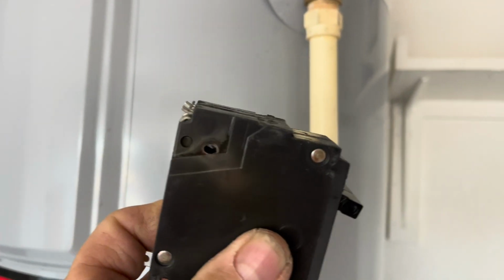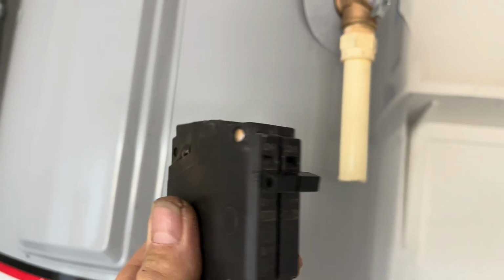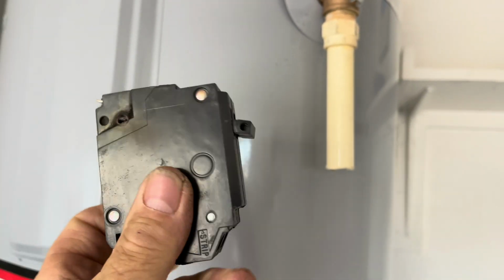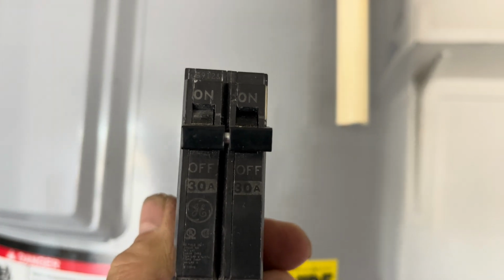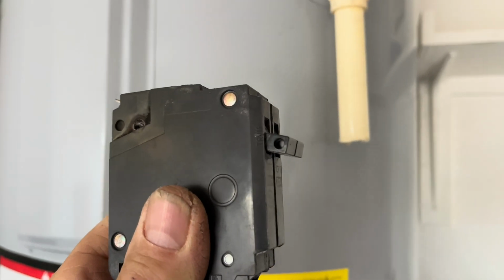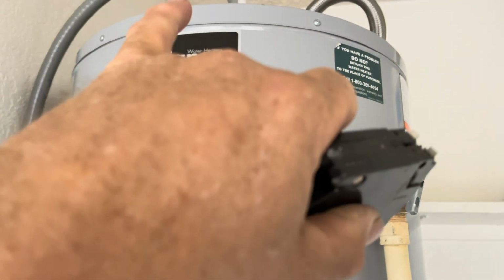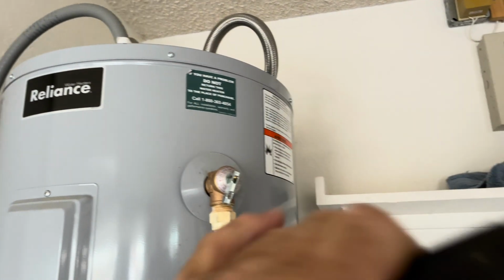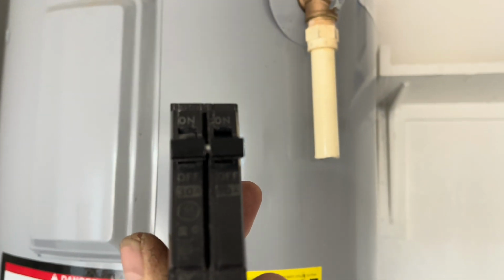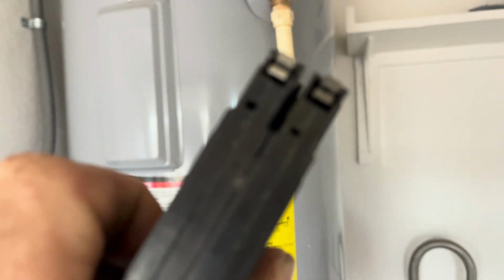The reason why she wasn't working was because of a burned out 2-pole breaker, double pole, which is a 30 amp. And these are the little ones. And that's why. So I replaced that. Everything's good. I'm getting 220 here, which means I get 220 there, because I wasn't getting 220. I was getting 110 on each side. And that's because the bar in the middle wasn't connected.